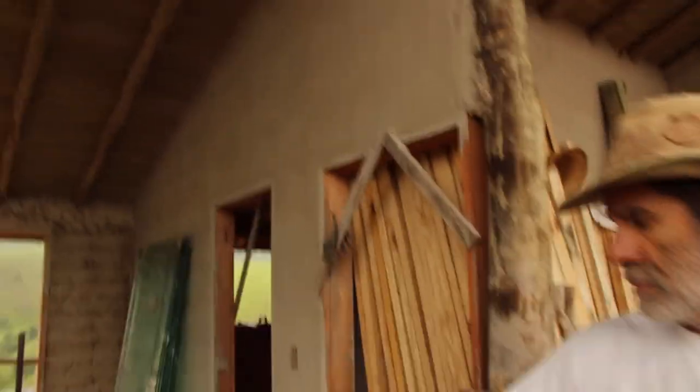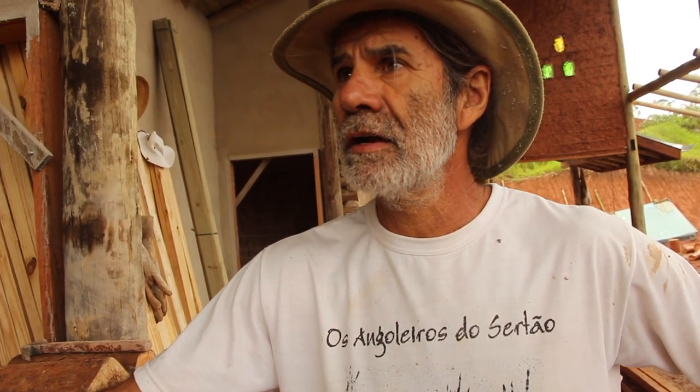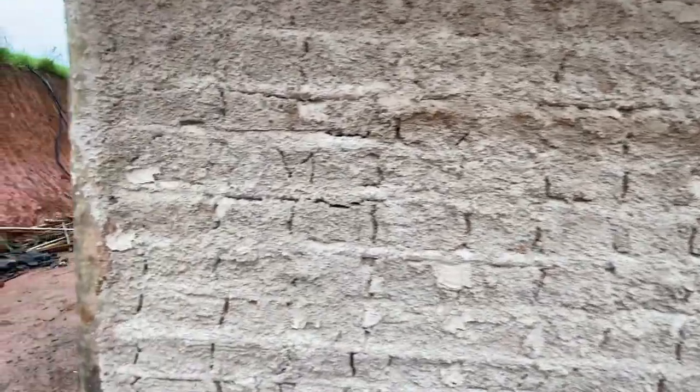This is pau-pique. Is this pau-pique too? No, this one isn't. This one was brick. Ah, over there it's already chapiscoed. For that chapisco we use three wheelbarrows of stone dust, one and a half wheelbarrows of earth — more earth than the other mix — and practically one wheelbarrow of virgin lime. No cement in that one. It looks like cement because of the color of the stone dust, which darkens it a bit, but there's no cement at all.